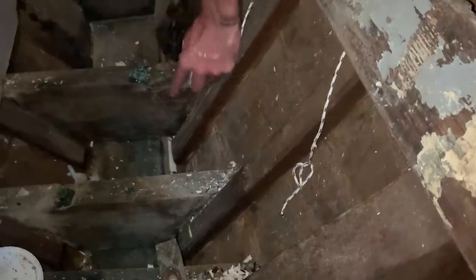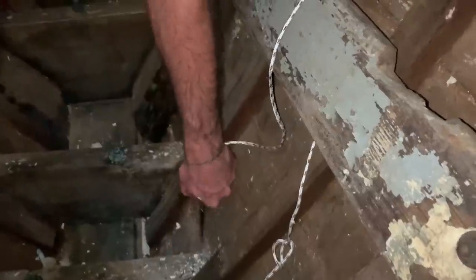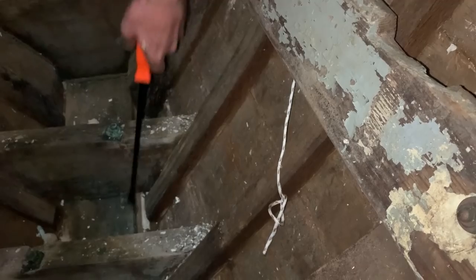Pry at the frames, check for rot — I don't think there's going to be any down there. Absolutely solid. Vessels usually rot from the top down, not vice versa, unless they're freshwater boats. Is there any wiggling? No. No movement at all. That's good.